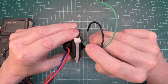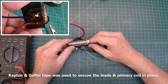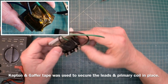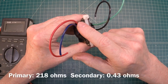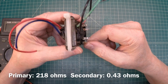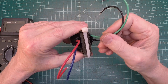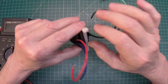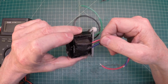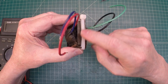I checked DC resistance and I realized I made one big mistake. I had the transformer set up like this, and when I was attaching my lead dressings, I flipped the transformer over. So what should be the primary is now the secondary — my color coding looks like it's correct, but it's not. I goofed up, and I may go back and change it — just a splice with some heat shrink — so I don't confuse myself in the future, or if someone else in the repair world ends up with this radio again, they don't make a mistake.